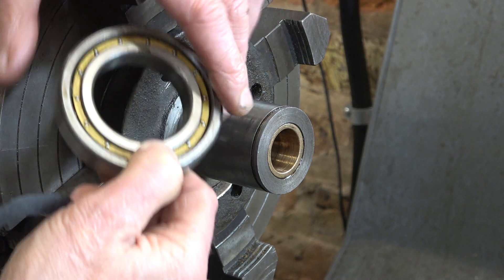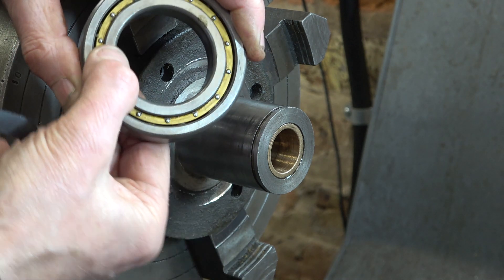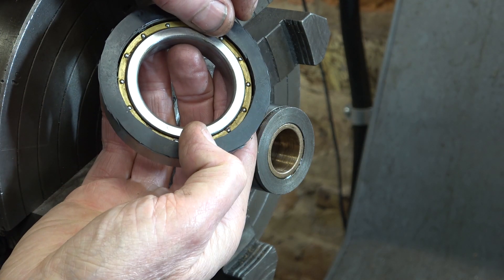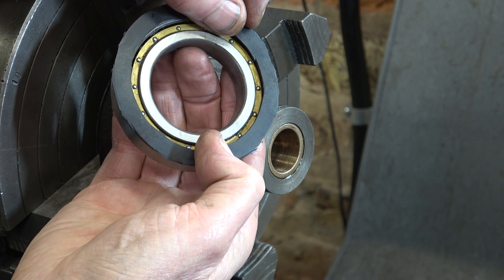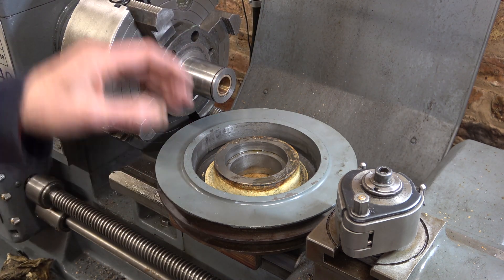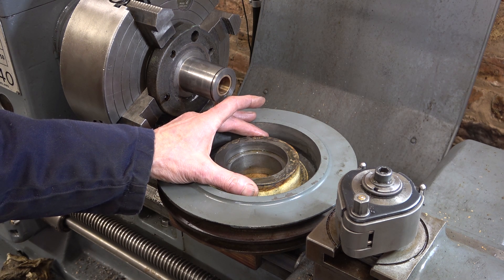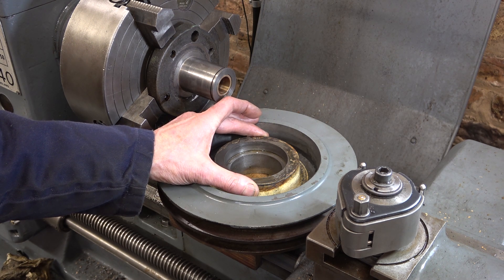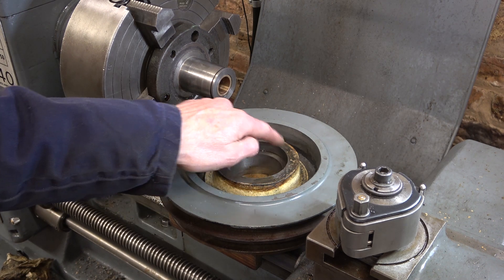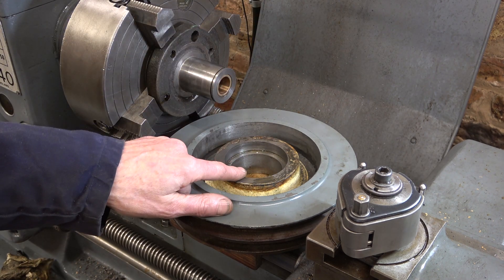This edge is about here so there's still a gap, and the dust would get in — evidenced by the fact that both bearings are as rough as anything. So the neoprene seal goes just over the outside and hopefully keeps the dirt out. For this other end, I can't put a shield there because there isn't room. So I'll put something on this face — I've ordered a disc of 2mm steel plate, already cut to size, arriving in a few days. We'll put a hole in the middle to go over the snap ring, and with 5 UNC 6-32 countersunk Allen screws that'll be the shield on this side. While we're waiting for that plate, we'll take a look at the bull gear and set it up in the mill.